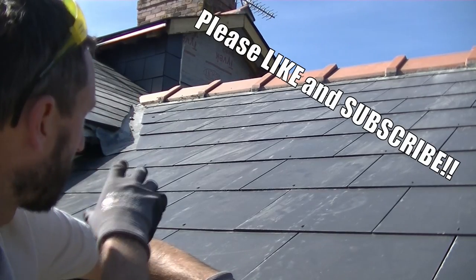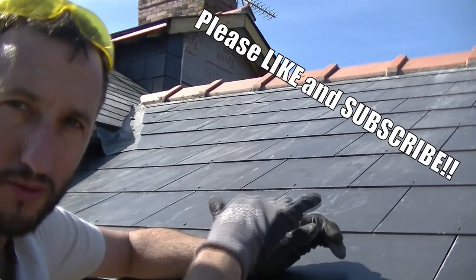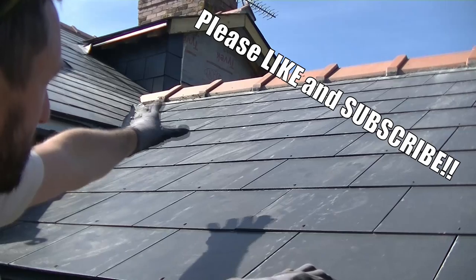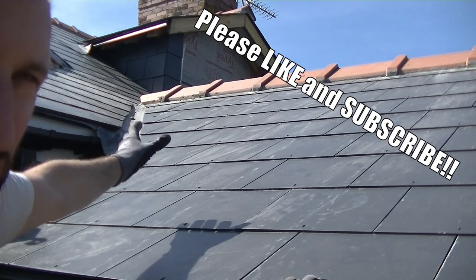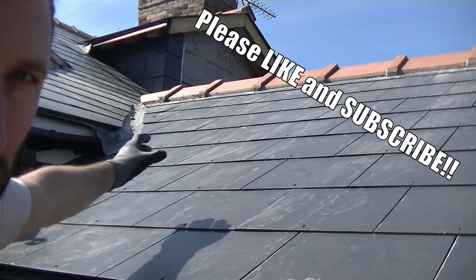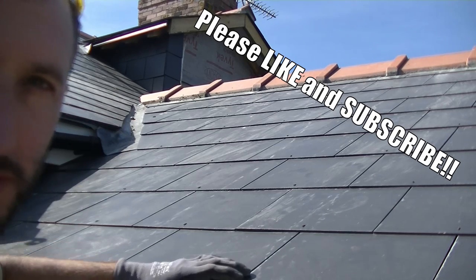All right so I've just done the last two ridge tiles. I put a screw in the one from the end - I actually put my own drill hole through it, popped the screw down through it just to make sure that one's secure. The last one you obviously can't secure it unless you put a hole through it - there's no point because I'd go through the lead - so I've just stuck that down with the cement or the mortar mix. The only thing to do now, I'm not going to film because it's a bit awkward, I just pack a load of cement behind the end of it and then we can crack on with some other jobs.